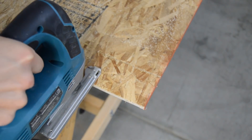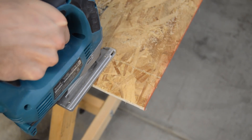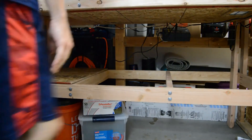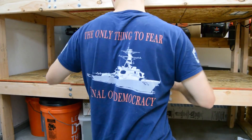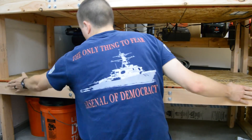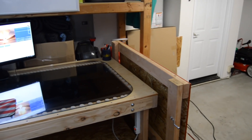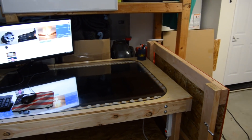To finish the shelf, I cut a piece of 3/8-inch OSB to fit and cut the corners out so it would fit around the legs. I had to cut it into two pieces to be able to install it. I selectively cut the board such that the end of each half would share one of the cross members, so there would be limited wobble or looseness in the shelf. After screwing in the shelf, the desk was complete.